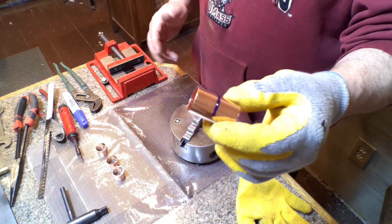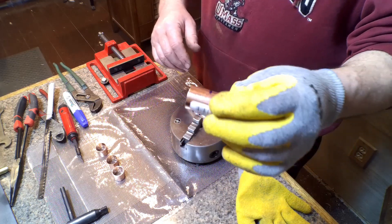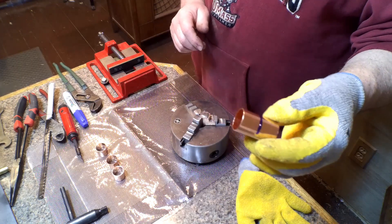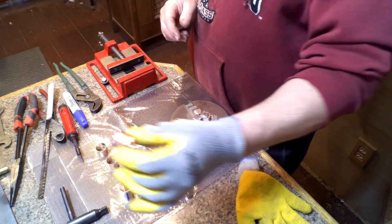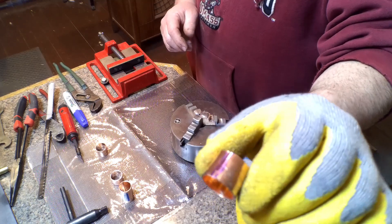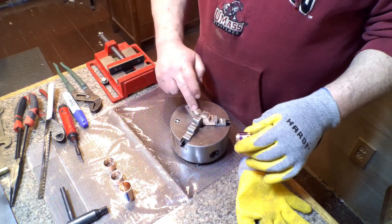Luckily in my chuck here it's exactly half — cut it in half, it's perfect. These pipes with the union have a little dimple in there, so it gives you the halfway point pre-marked. I just put a blue mark there to show you on camera, then I cut them in half. The next thing I do is slice it right down the middle — that's where you get your split.